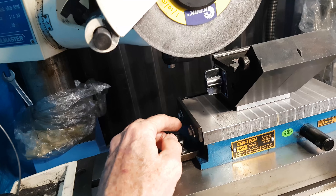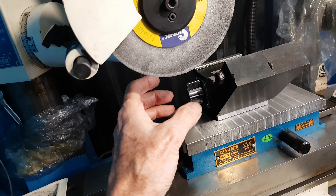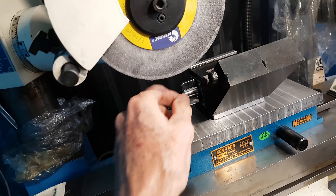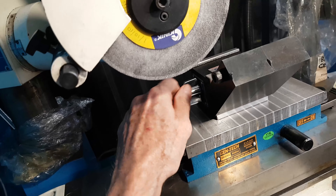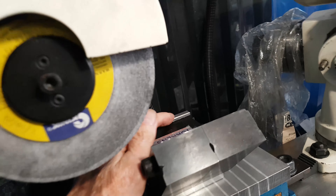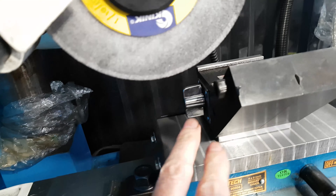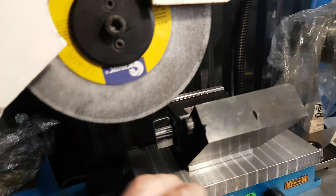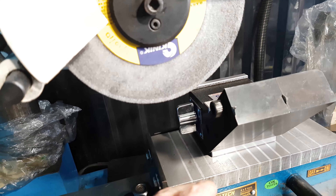You pop that down, set your job up, lock it so it's magnetized. But then when you're trying to undo it you're likely to move it. So every time you put a job on, you have to reset it up. If you can use those little flats there and clamp it down on your mill or something on here, that will save you a lot of mucking about.